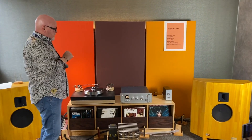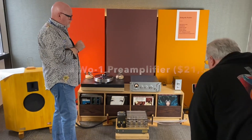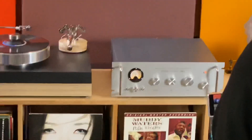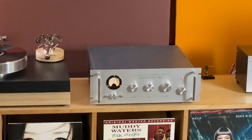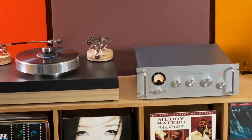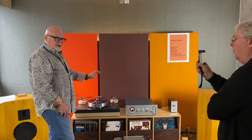That is fronted by the Miyajima W01 full function pre-amplifier. It has two phono inputs — one of them is loadable. It doesn't have a volume control. It has an active gain tracking device, which is why the meter is there, so you can take the two 6SN7s that make that voltage amplifier and control the volume precisely.